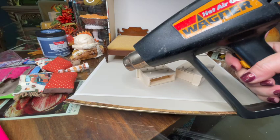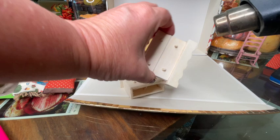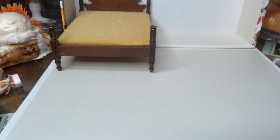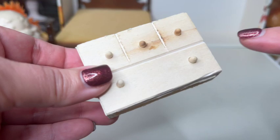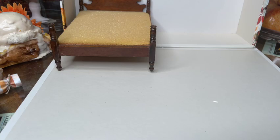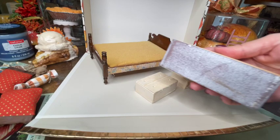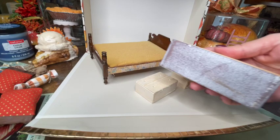The next step is to take my hot air gun and lightly go over the areas I want to take apart to remove those pieces of wood. Be really careful with hot air guns — don't hold the piece in your hand; use a pair of pliers so you don't burn yourself. You can see I got a couple little brown marks because I held the gun a little too close, so just be aware of that. The next step is to remove the drawer pulls — I'm not going to be using these again for this dresser, but you can put them aside for something else.